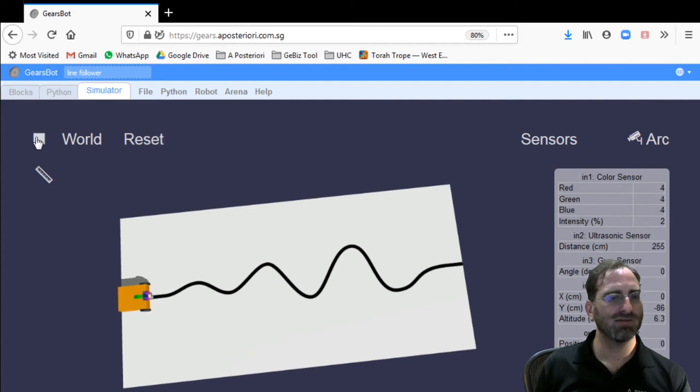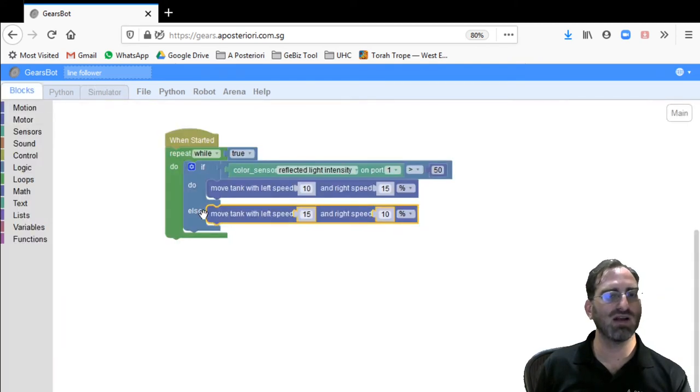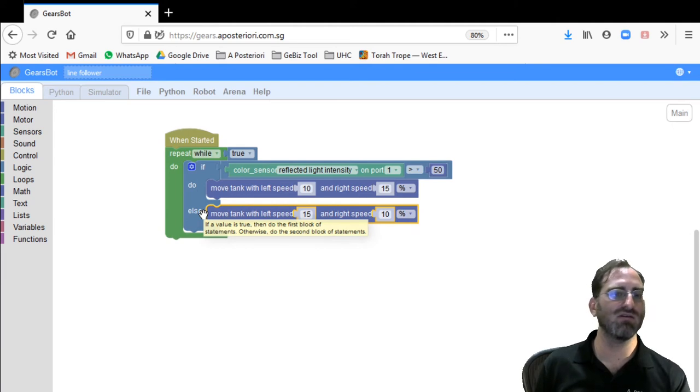Okay, we're back on the line with a slightly wider angle tracker, and we can see that we have pretty much the same problem where we cross the line at some point because we're not able to quickly correct our error of which way we're going. So that suggests maybe that we're not turning sharply enough because we're not able to quickly get our error and our bearings.